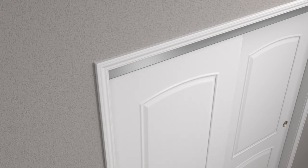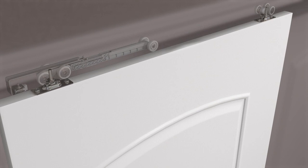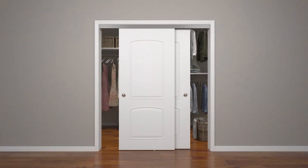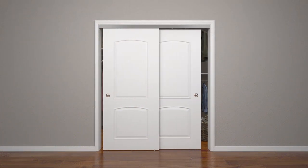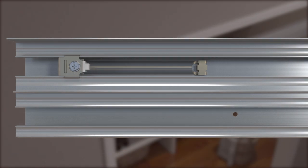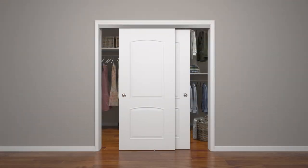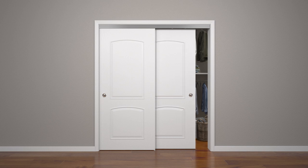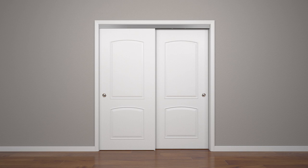Secure into position by locking the two metal lock tabs on the door plates. Reinstall door guide. For soft-close action, slowly close door. Check to make sure door touches jamb. If it doesn't, slide door away from jamb and readjust actuator arm. Slowly close door again. Check to make sure soft-close dampener is working properly and closing door slowly until it meets the jamb. Then check to make sure the other door closes properly to meet the opposite jamb.